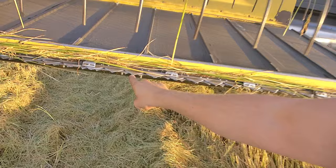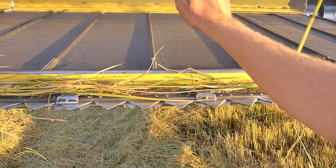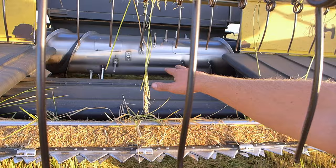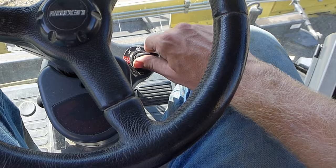The sickle blades here are razor sharp. That cuts the straw about eight inches off the ground. As it's cut, the rice lays down flat. The center draper shoots it straight into the beater drum. The beater drum beats down the straw on the rice as it's being prepared to be processed straight into the harvester. So that's the header — you're going to see a lot of that in action.